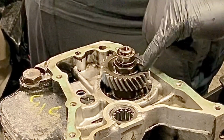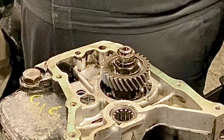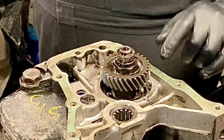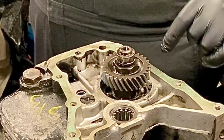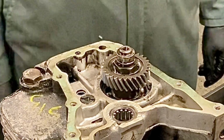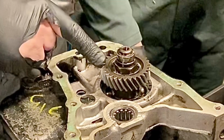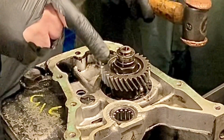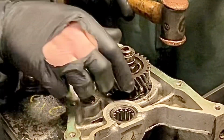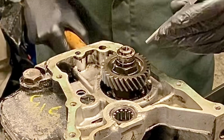Now what we need to do is knock the tab flat. Okay. Yep. And then we'll use the large nut gun. And before we use the nut gun, we'll lock the transmission so that it won't rotate. Things like this, you can determine that it's been messed about with before, because you can see the factory wouldn't do that. They have a little pinching gripper that grips them up nicely. That's been hammered back over, so we already know that somebody's been in this gearbox.